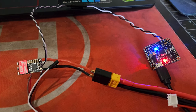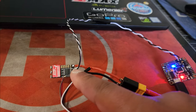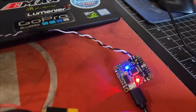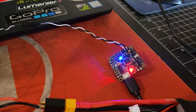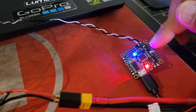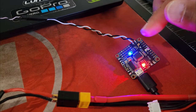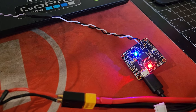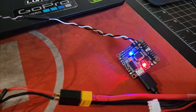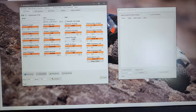Now we're done with the ST link. For configuration you need to be connected to the signal wires — I had to actually solder that on because I totally forgot I was going to need it. You need your battery and a way to connect to the PC through the signal wire. If you watched my last video, I'm using a flight controller — all you have to do is solder to one of the motor outputs. This probably isn't the cheapest way to do it, but the guide also gives instructions on how to use an Arduino.